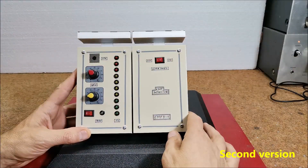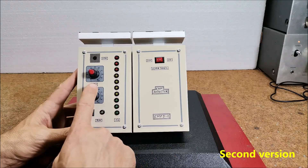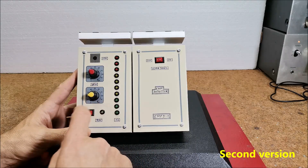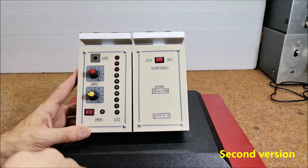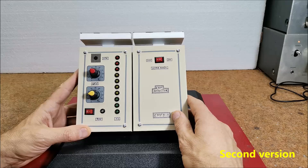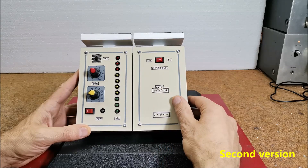In the first version I mounted the Arduino in the same box along with the LEDs, potentiometers, and other electronics, but the instrument worked very unstably and was subject to self-oscillation. After some testing I mounted the Arduino in a metal box that is grounded to the negative pole of the battery, which greatly increased the stability and sensitivity.